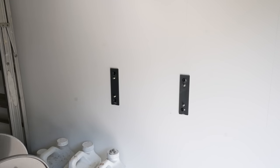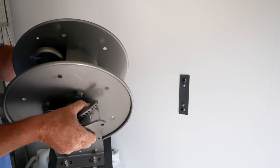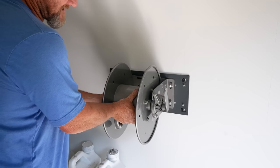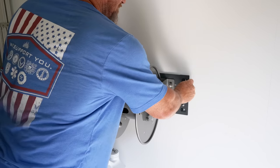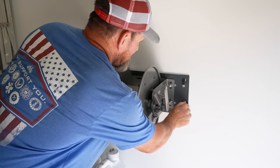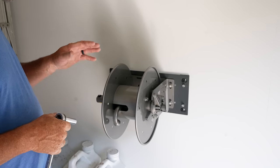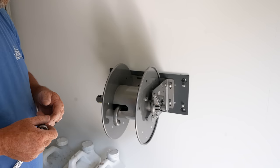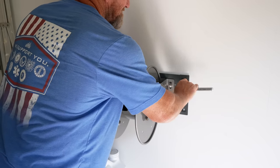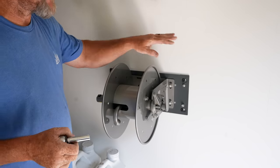Do not put the pressure washer hose on the reel yet - do that later to make this an easy install and don't wear yourself out; it's heavier if you pre-install the hose. Hang it right up on the wall, make sure you put a little pressure on it and hold it up there. Take your four 5/16 stainless steel nylon insert nuts and put it back on. When you tighten this up on the wall, please use a ratchet - don't use an impact - because you don't want to pull the pin studs out. Tighten them up until they're snug, flush only. Do not over-tighten these.